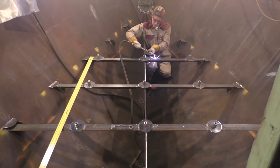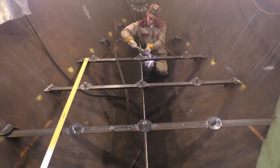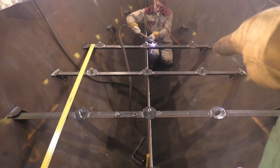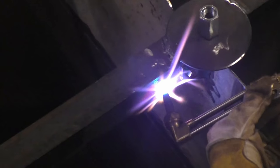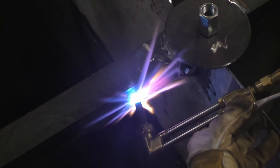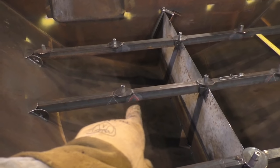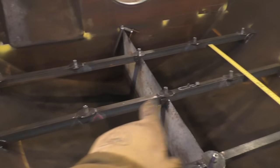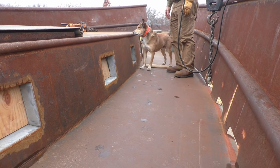There's a little weld distortion in these pieces, so what Joel's doing is heating up a little triangle. Now they're actually high on this wall - pushed down underneath their pads on the side - so since they've got some force on, we're heating them up so they'll stay in that position. The triangle is wider on the bottom and pointy at the top. There's the first one that's been heated - we did two triangles but only used one. If it doesn't work with one, you come back and do another, and that got it fixed. This is straightened out now - no pressure here anymore.